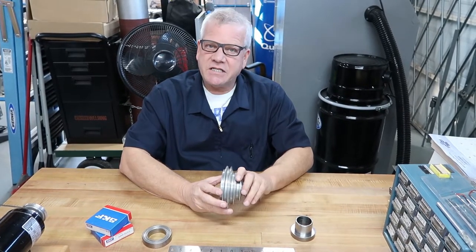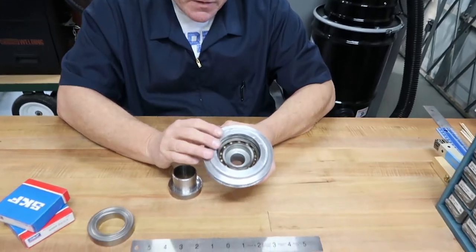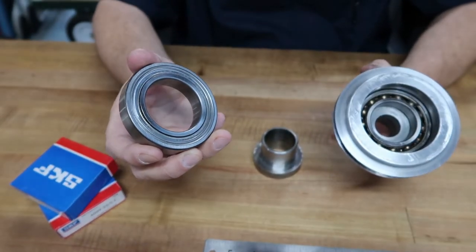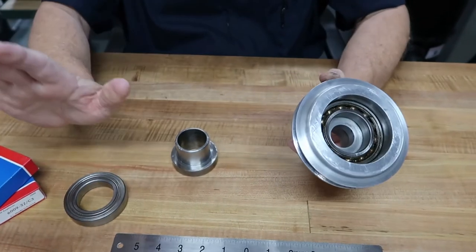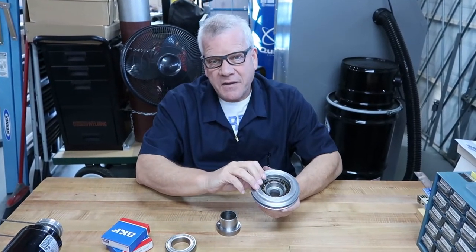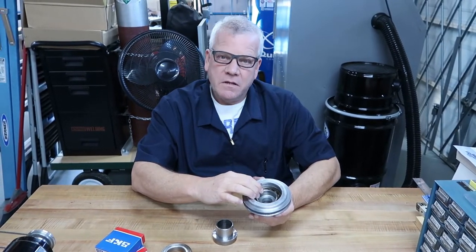This machine has a secret. What happens here, we're going to try to get this bearing out, and that's what this is all about. We got one bearing out, and this is how they originally looked before we just slaughtered the one inside of here. And before anybody gets started about removing this bearing, I just want to mention, if somebody starts talking about heating up the aluminum here to expand it while freezing the steel to remove it by shrinking it using dry ice, we already have.